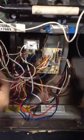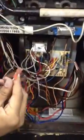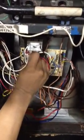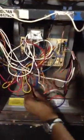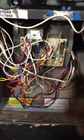You also have a neutral we didn't hook up earlier — this neutral should be coming from the flame sensor. Go ahead and put that neutral on the neutral bar. We're also going to have another neutral to hook up from the inducer motor. There should be one more white wire down here — that should be the neutral from the inducer. The only thing that came out of that pin connection was your hot, so that's the only thing we got out of there. Let's just make sure there aren't any more wires left unhooked. Normally these wires will be zip-tied and out of the way so you can get in and work around your furnace.